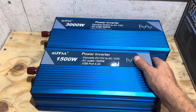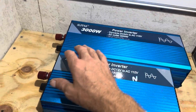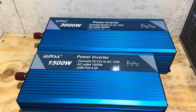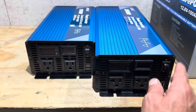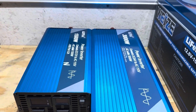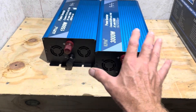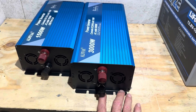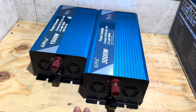Here's the 12-volt Alpha pulled off the wall, and there's the new 24-volt model. You can see the same width, same terminal designs on the back — the 24-volt one is just a few inches longer. Side-by-side from the front, same layout as the 12-volt: switches and everything in the same position, same displays. Very similar, just larger because it's 24-volt. Looking at the rear of the inverter — same terminal design, same cooling fan design. The screw mounting holes are the same width apart on both models.